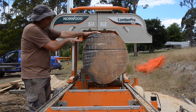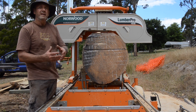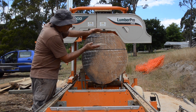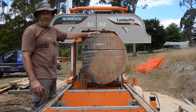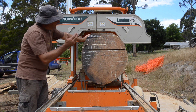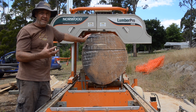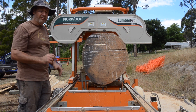See that little bit of lift there? The top board — I've released the growth stresses. Small-diameter logs get a high degree of growth stresses because they're there to hold the tree up in the wind. In a larger log they're less important because the tree is quite sturdy. But it still means that before I cut these boards off later, I'll have to do a straightening cut — I might take off both edges to release more of the stresses before that step. We've now taken off our first section that we'll remove, and then I'll turn the log and continue the process. It's called breaking down — I like to think of it as releasing those growth stresses, letting the timber relax before I cut those final boards.